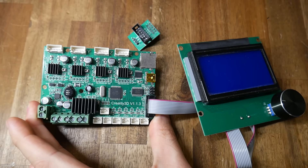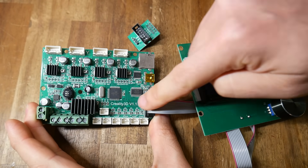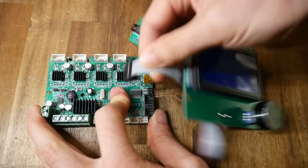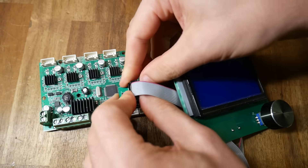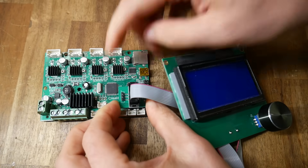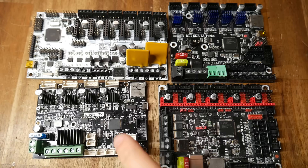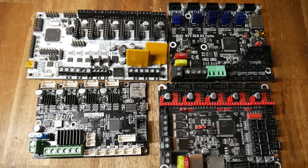Let's address some frequently asked questions, such as: do I need a pin 27 board? Some older mainboards like the version 1 boards from Creality had nowhere to plug in the BLtouch, but there was one spare PWM pin that went to the buzzer in the LCD. The job of the pin 27 board was to plug in between the LCD and the mainboard, hijacking pin 27 to stop the buzzer from working but making it available to control the BLtouch. Any modern board however is going to have a dedicated BLtouch or servo port spare, and that means a pin 27 board will not be required.